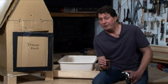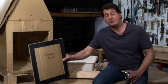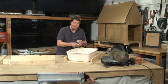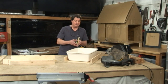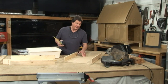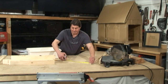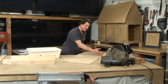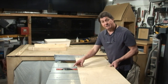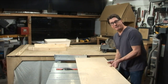The first thing we're going to build is the actual drawer for the litter box, because the drawer is going to determine the actual width of the lower part of the cat house. Now this pan is 16½ inches by 22½ inches. We want the base to be ¾ of an inch wider and longer than the pan, giving us 18 inches by 24 inches. We're going to cross cut this at 24 inches using the table saw, measured at 24 inches from the inside of the blade to the fence.